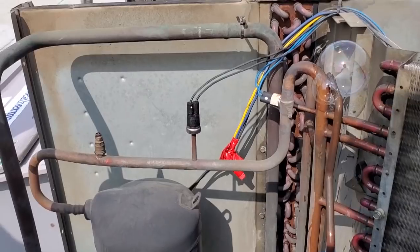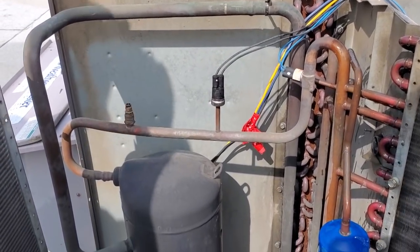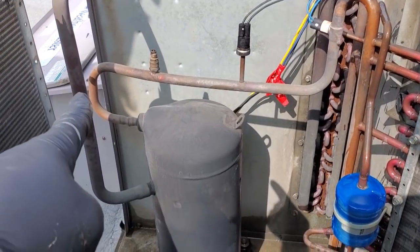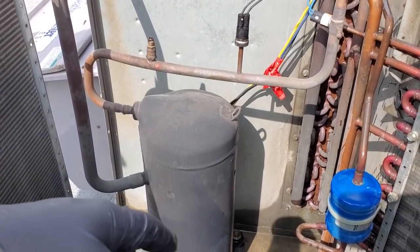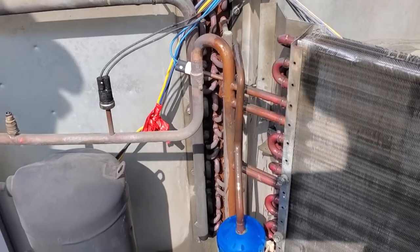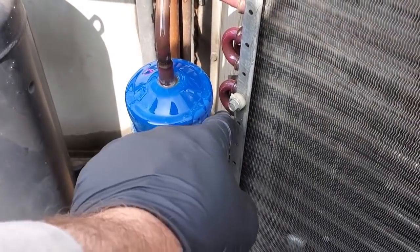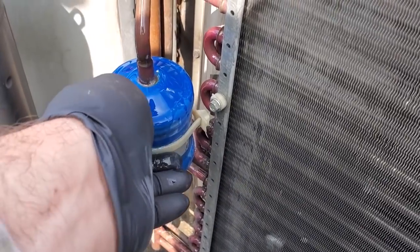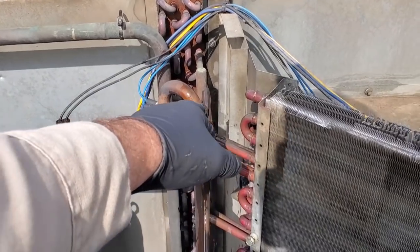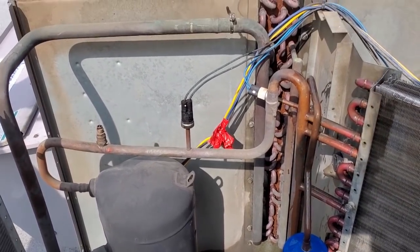What happens on these units — the compressors make a really loud sound and vibrate, you could feel the whole unit vibrating. Something goes wonky in them, a bearing or something like that, and they start vibrating really bad and just wreak havoc. Usually on these units we crack a discharge line coming out of a 90, right there. It's simple to say let's just weld that 90, but why did the 90 crack? Why did this rub up against that? This zip tie broke — there used to be a zip tie here holding that dryer. The compressor is vibrating to all hell, making everything in the system shake. We could fix that leak, but it's going to happen again unless we change that compressor. So we're going to put in a quote to change the compressor, fix the leak, and go from there.